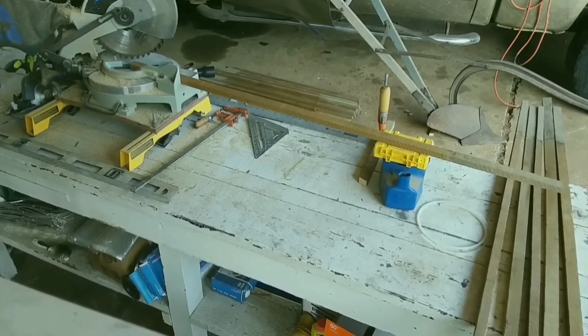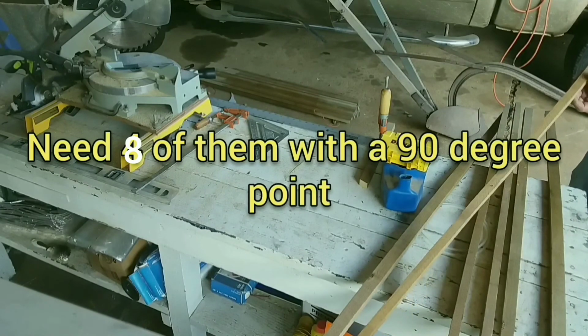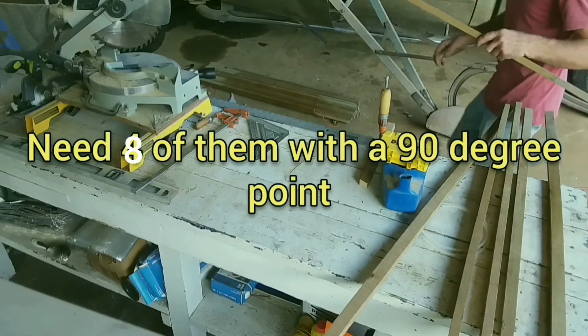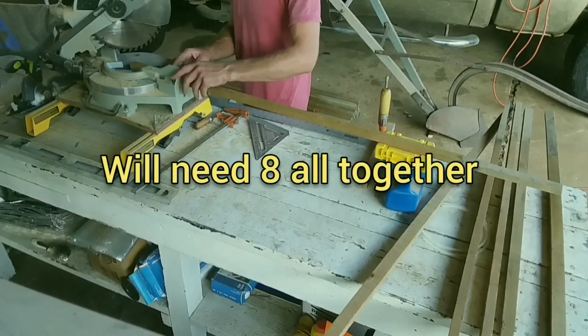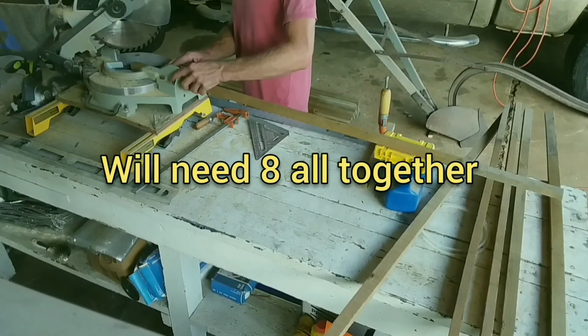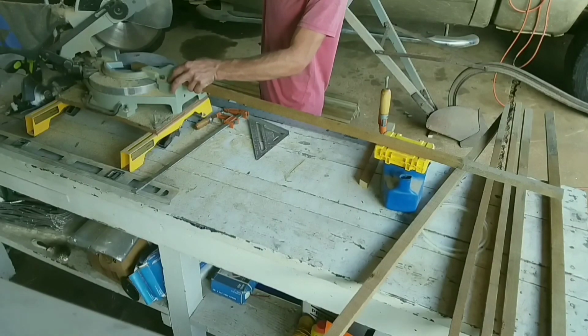So I have these tomato stake things for my spokes, and I'm going to cut a 45-degree angle on each side of the spoke to make a point down the center. Try to use your best judgment on material. Find a repeatable way to set this.